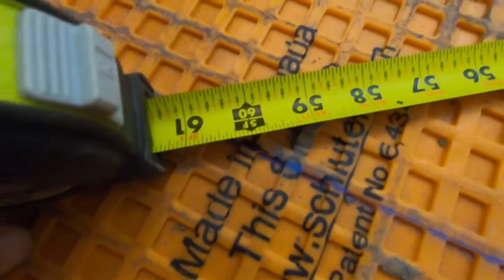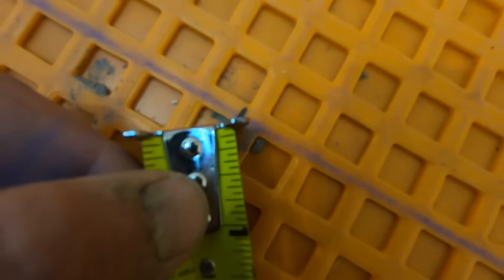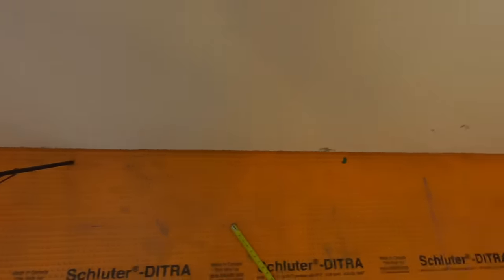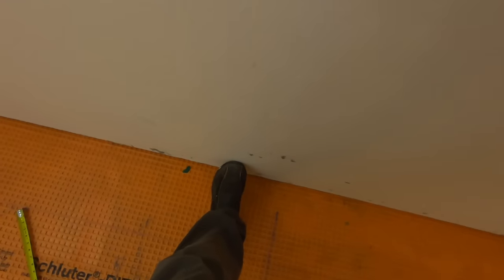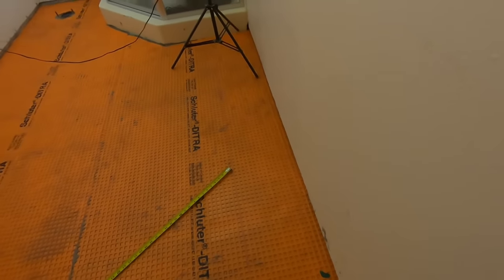Right here is my intersection. I'm going to put the 5 of the 3-4-5 right there. You can see we are really darn close — there's my intersecting line. That's pretty darn good for a finished basement. Most of these walls, even though they do bow, they're all flexible, hanging from the ceiling. So you're going to get some wiggle in these walls here.